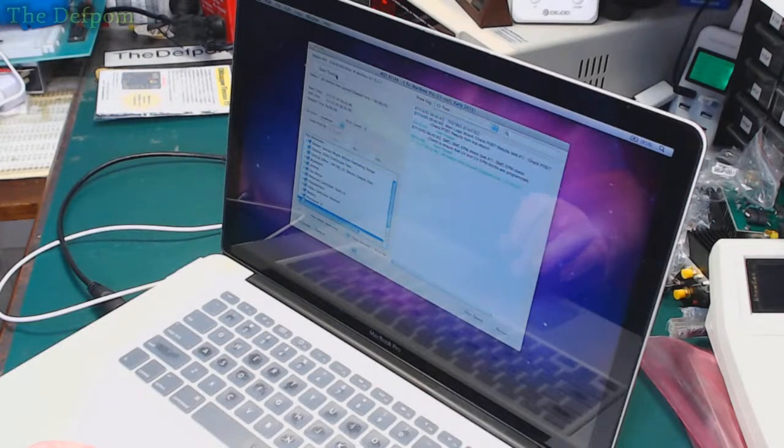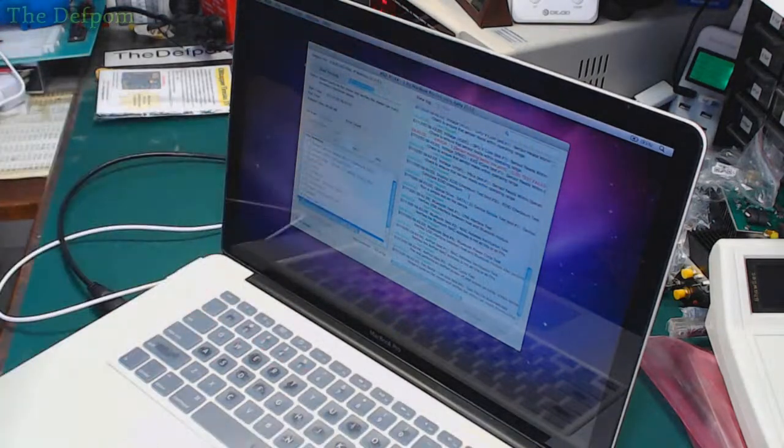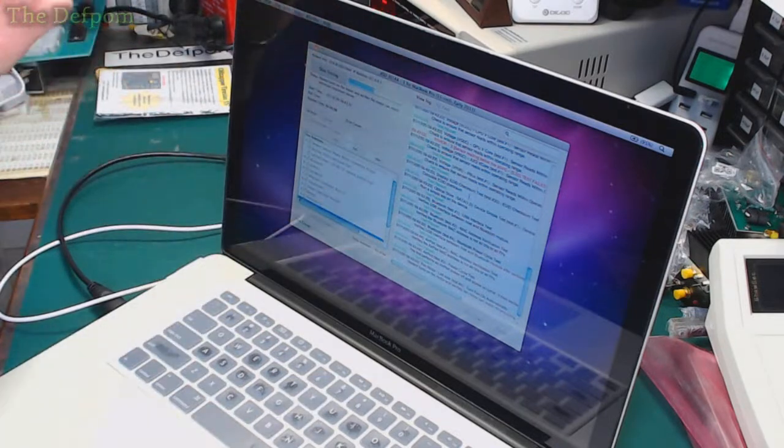This is going to take a while, so let's get it going. And it will fail GPU. So, sensor reading below. Yes, right, because GPU Vcore is turned off. If that wasn't turned off, that wouldn't fail for that. Okay, so there's a close-up view of that error there. That's fine. So it's done the fan test now, and it'll do a sleep test as well. Shut the display off and shut down and start back up again a little while later. So I'll come back once it's finished.